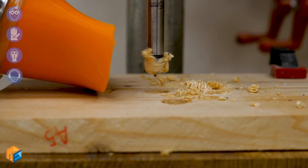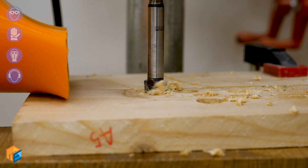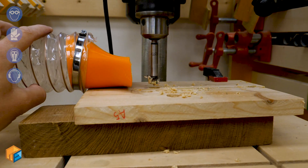To catch the sawdust we need a force greater than those forces combined. This force is given by air pressure, which lifts the particle. Then the momentum given by air velocity carries the particles through the pipe, so we want the highest possible pressure. Pressure is the reason fluids move through piping — it's the energy of the fluid, and we engineers call it head. We also want the highest possible air velocity, but air scrapes along the pipe walls and produces friction. Even air produces friction, which means we lose energy and we lose head.